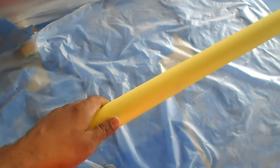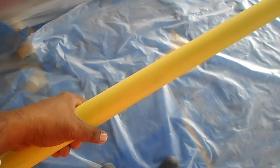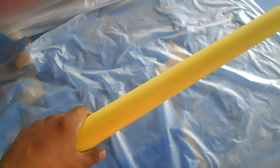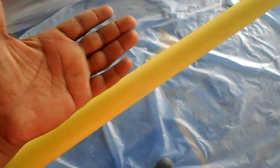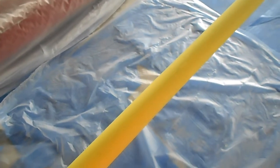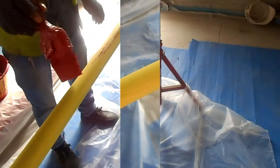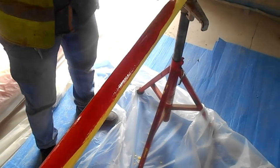For the second coat — as you can see, the first primer coat was applied two hours ago, and after another two hours the second primer coat was applied. Now it's completely dry and we are applying the first coat of red paint — synthetic enamel gloss vermilion red.